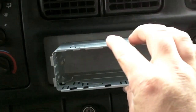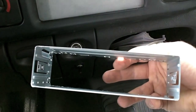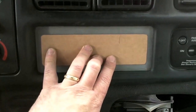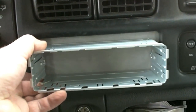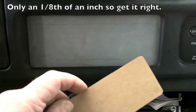Now the next thing to do is mark and cut out the inside opening. You could put the cradle up and trace it directly, but I highly recommend instead tracing it and cutting it out in some stiff cardboard or stiff paper to make a template — because then you can actually center your template the way you like it, tape it down, and get a decent mark. I just made a template out of some cardboard and it makes it much easier to center, as opposed to using the actual cradle which was difficult to get centered.